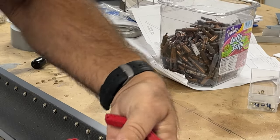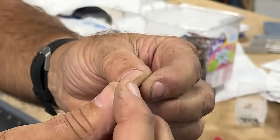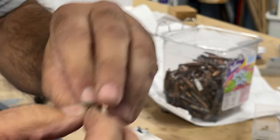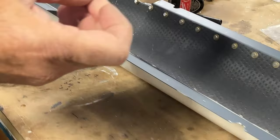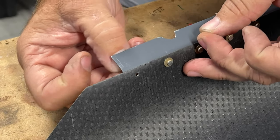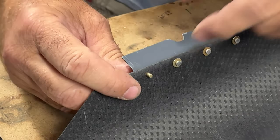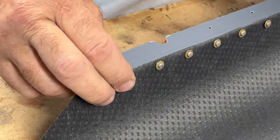You can see how easily it drills out — and now you can see that this washer will slide down over this rivet very easily. That's what we want: a nice fit. I left a hole open here to show you — the rivet goes through right here on this side. The manufactured head of the rivet is against the metal.